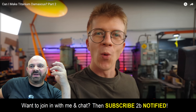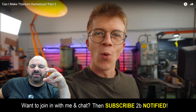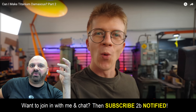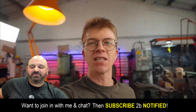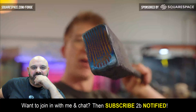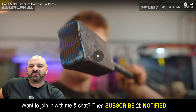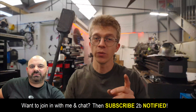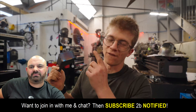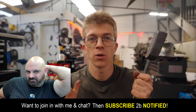So the first part of this, he made a Damascus billet out of titanium, which is going to be really, really hard. So this is part two — I think he's going to make some really cool rings. Welcome back to part two of making titanium Damascus. In the last episode we bloody well did it. We have grade two and grade five titanium Damascus. We've only done the bare minimum so far — it's forge welded into a straight laminate stack, but I want to go further, documenting the process of figuring out how we can go all the way to making crazy mosaic patterns out of this titanium, experimenting with other metals and alloys within it as well.